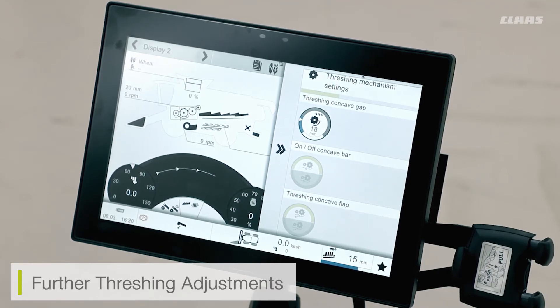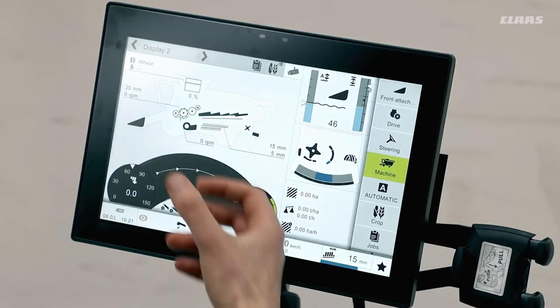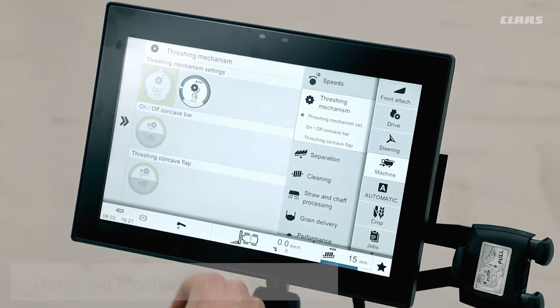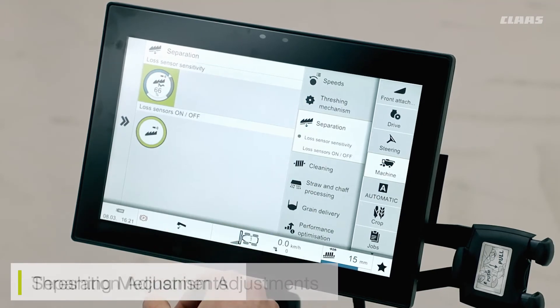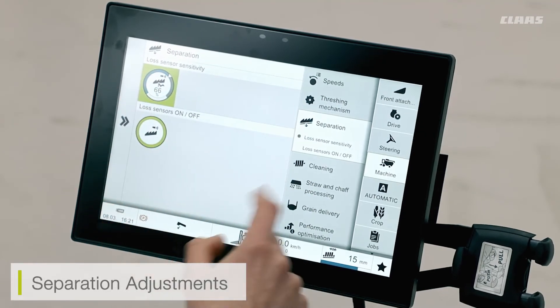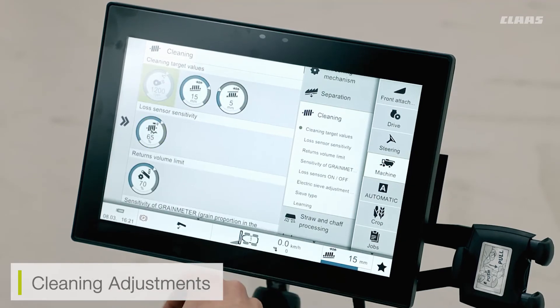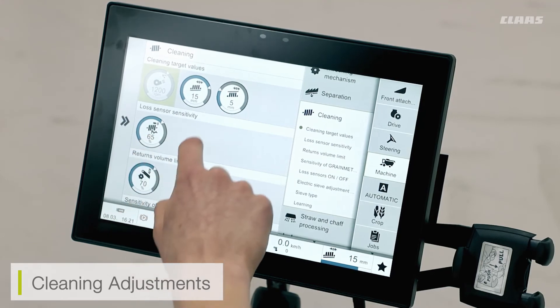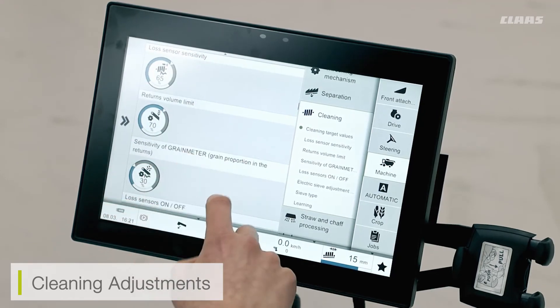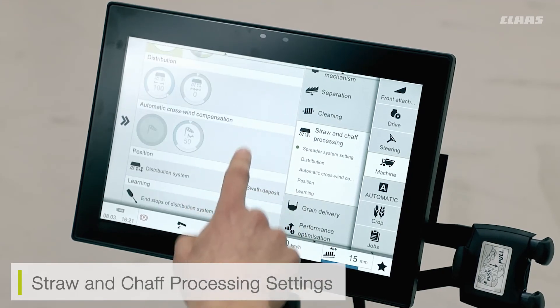If I have a greener crop, that gives a better grain sample. If I don't want to do anything via the main screen, I can also go into my machine sub-menu. Here I can load in any of my threshing mechanism adjustments, my separation adjustments — and if I was using a hybrid machine I would also see the likes of my rotor speed and rotor cover plates movement. I can see my cleaning adjustments, be that my upper and lower sieves, my loss sensor sensitivity, or my returns volume sensitivities, and then the likes of my straw and processor settings.